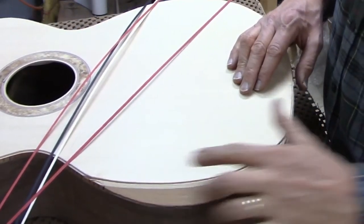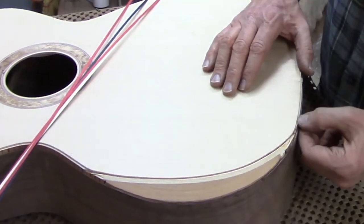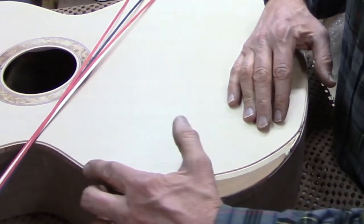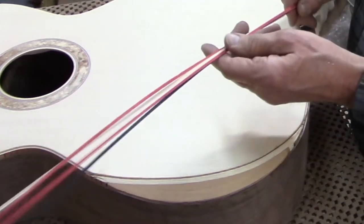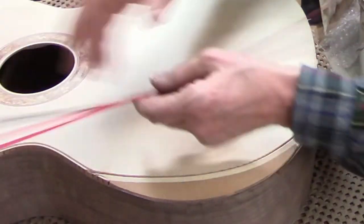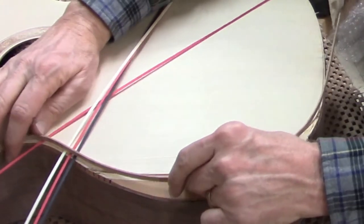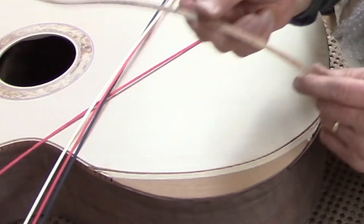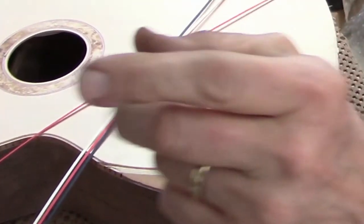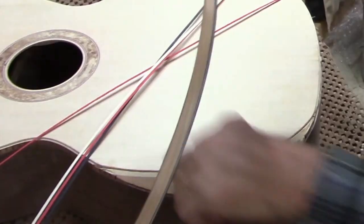I've got my channel cut for the binding and for the purfling, and I've cut the channel that goes down along the side of the guitar body and the bottom of the bevel. I've cleaned everything up so I have nice fair curves at each end. I've got my wood veneer purfling lines here that are going to go around the top of the guitar, and then I've got my maple binding — nice curly maple — that will go along the outer edge of the top and then on the side. Ultimately it's going to look like this: there will be the maple and then a black-white-black wood veneer purfling line running along the side of the guitar.